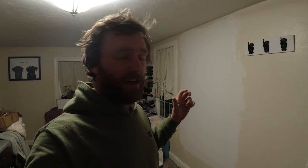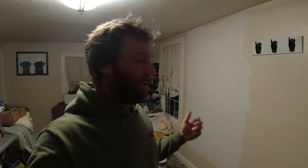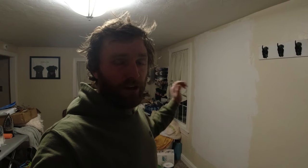And then I just took my 6-inch drywall blade, swirled it around and roughed it up. And then I did the same thing with my 2-inch blade. And then once it dried a little bit, I took my 8-inch drywall blade and just knocked all the high spots down. So that way, I'll see if you guys can see it, you get these little swirl marks that are somewhat flat. And like I said, it mimics this. It might not be perfect, but to me, it matches enough to paint it. And I don't think it'll ever get questioned.